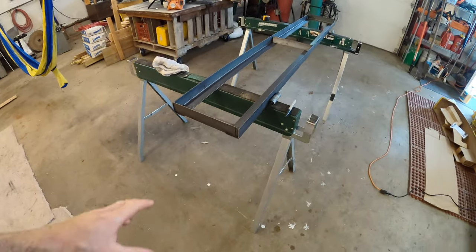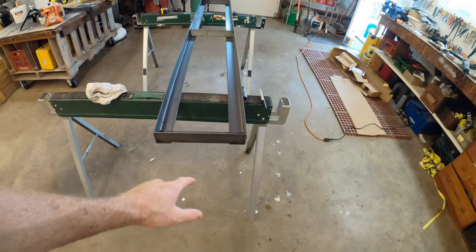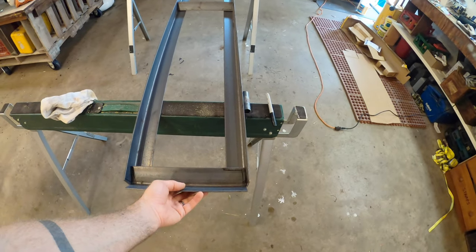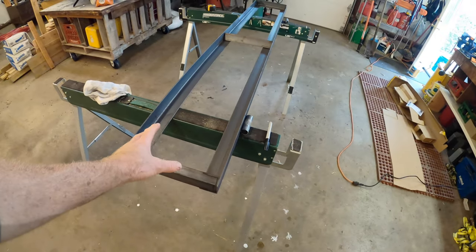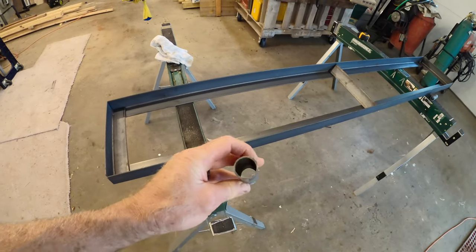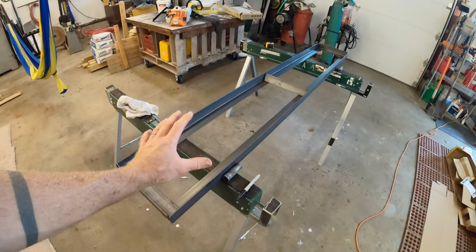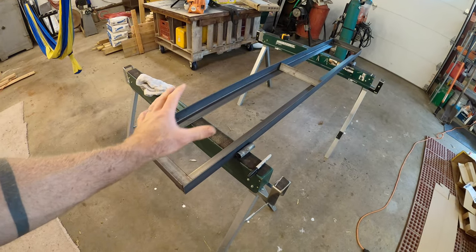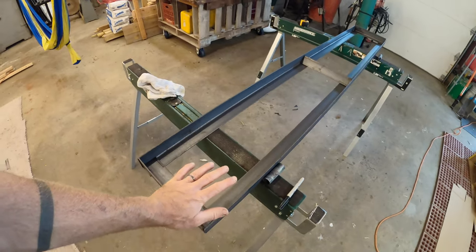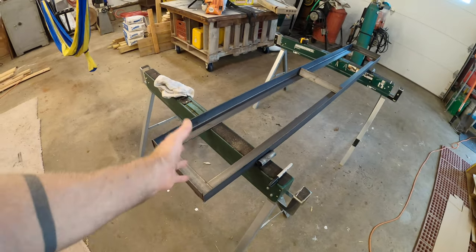Here's the layout for the new super small back gate — just angle iron, and I still need to grind it and clean it up a little bit before I weld it. These guys are little sleeves that are going to work as the hinges. Basically this thing is a copy of the big gate, just a lot shorter. One additional thing is I'll have some wire mesh on here just so air can flow through but it will keep things in the trailer.